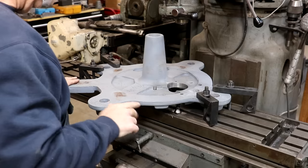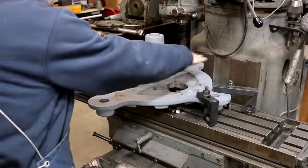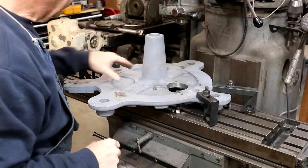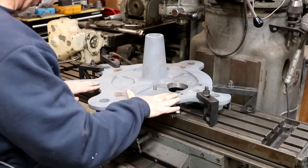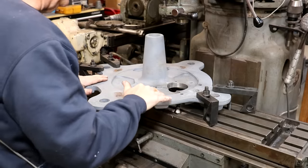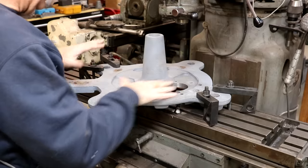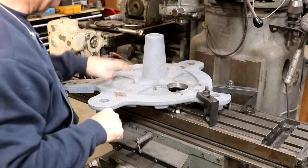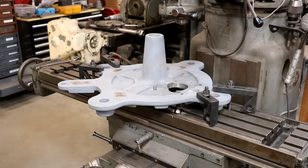When this was originally machined, it was put on a lathe and this bottom flange here was machined flat — the whole surface out here was machined up to the center hub. But I'm worried about making sure that this bottom machined area is going to be in the right plane with my table and my work. Even though this is machined, it was machined over a hundred years ago and pretty roughly. So I'm not going to get a super accurate reading on the indicator, but I'd like to get this within a couple of thou of being flat. Let me get an indicator rigged up and sweep this surface to make sure it's fairly flat before we start machining.